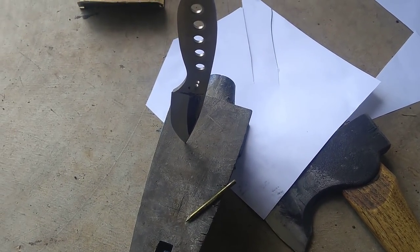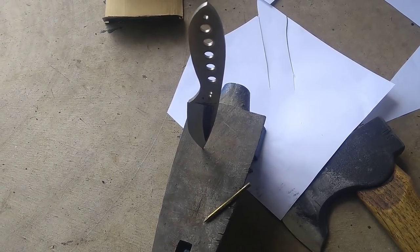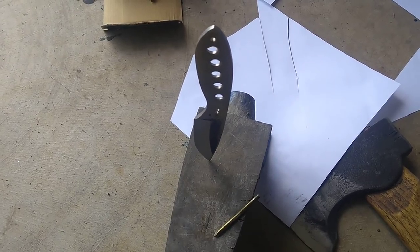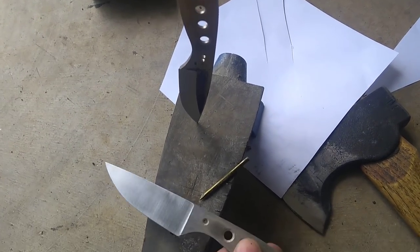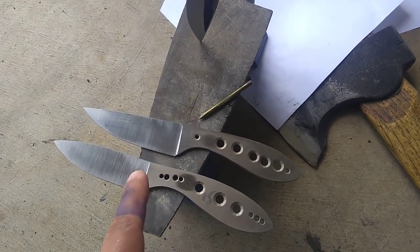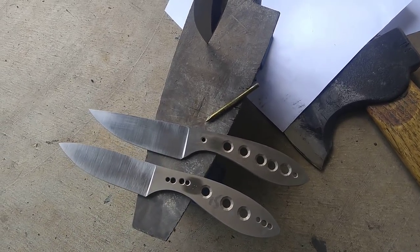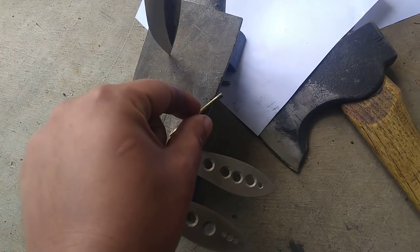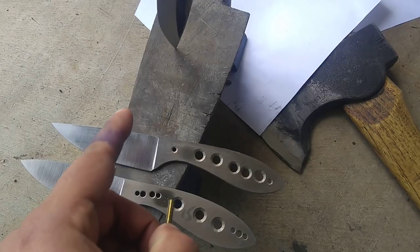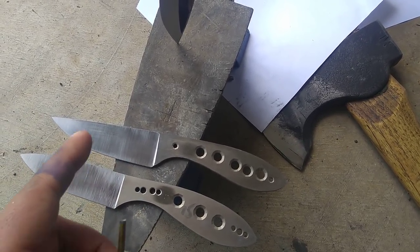The video basically talked about how geometry is really the biggest, most significant factor, and that is true. But we also have to talk about how carbide volume affects that issue as well. Because when you start going really high in carbide volume — stuff like CPM10V rough ground, CPM15V also rough ground, both about 64 HRC — the problem you run into is that when you're sending energy through the blade, stress connects the dots through the carbides and makes it easier for the blade to fracture.